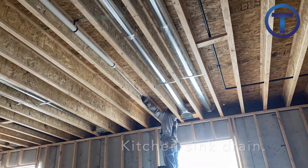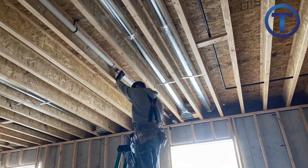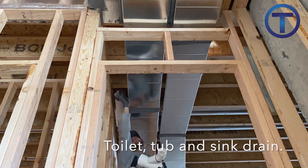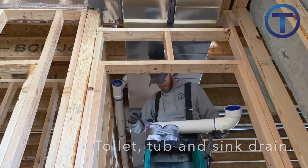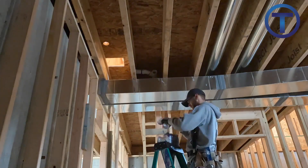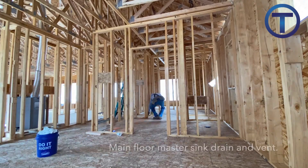I'm still running branches in the basement. I had left a wye for the kitchen — it's got to go all the way across the house — so I'm coming through the joists, supporting it every four feet with the plastic plumber's tape and making sure it has proper slope. If I can hang close to a duct where they're going to box the ceiling out, that's a great place to run pipe, so they don't have to box out any more than necessary when they frame in the basement.